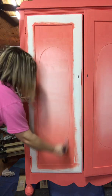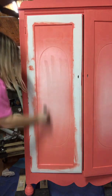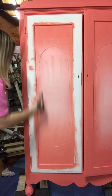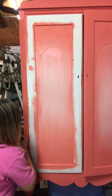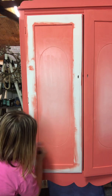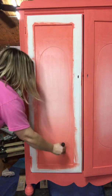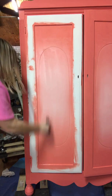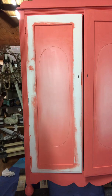put a second coat because I like to put at least 2 coats of paint on, even though we have 2 coats of primer, because I just feel like it is a better, more durable finish if it has 2 layers or 3 layers, 2 coats, 3 coats. But sometimes you come back and do your second coat, and for whatever reason, you just don't like it as well as the first. Because it's kind of hard to get it the exact same, especially if you're doing, like I say, a grungy kind of textured finish with drips and whatnot.